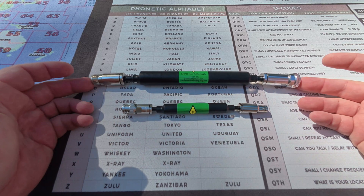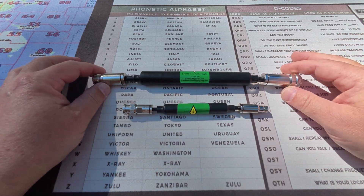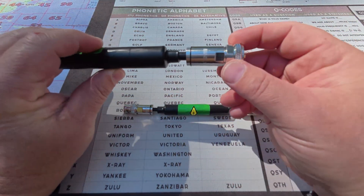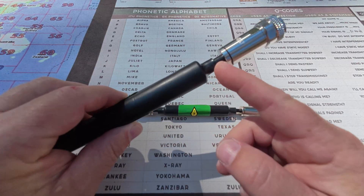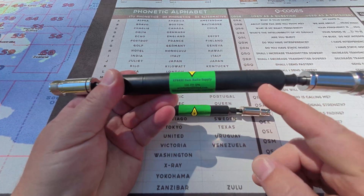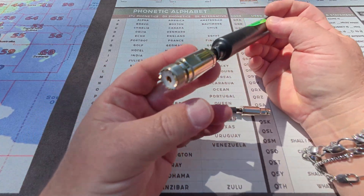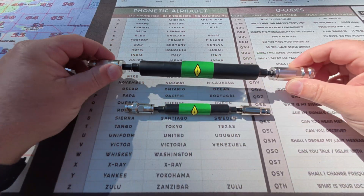And they look exactly like this. We've got two of the four that he makes. This one here is called the potichoke. We have first this beautiful Messi and Poloni Evo PL259, and then that is connected to the Messi and Poloni UltraFlex 7 coaxial cable. Then we have five Mix 31 ferrite beads in here, and then that is connected to the SO239 Evo connector from Messi and Poloni.